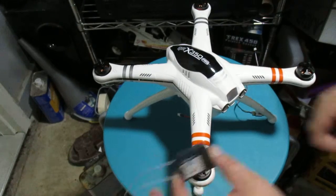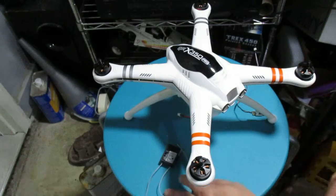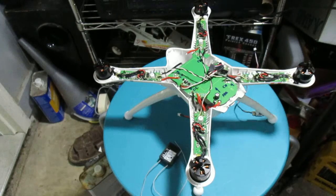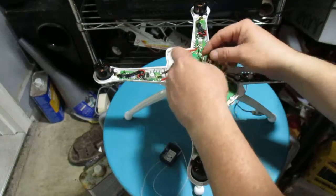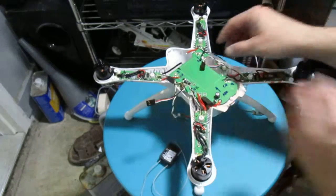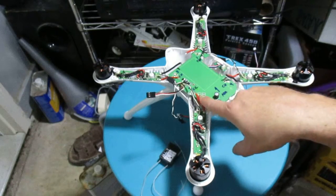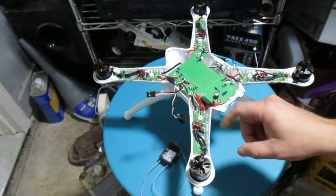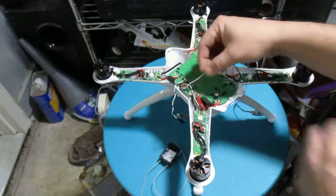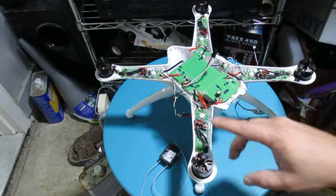Hopefully I won't have any issues with the Walkera receiver. The motors look pretty good — the black with white looks really good. The power control board I purchased was actually the newer edition, so you can see it looks different, it's bigger. There's one more 12-volt connection where you can add what looks like three other 12-volt connections, instead of being soldered where the battery terminal is.